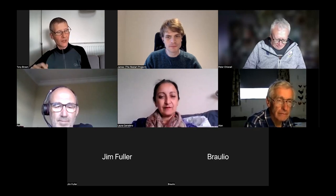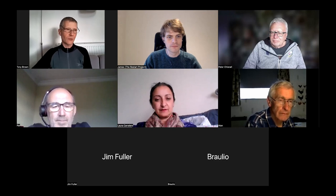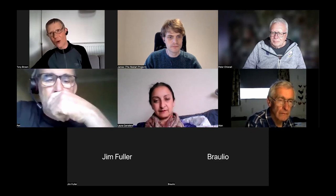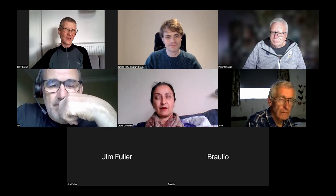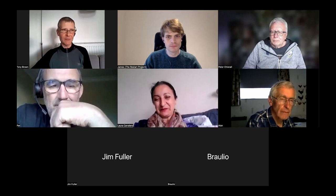Sometimes TVs, I didn't put this on the slides, sometimes they get discarded because of something really very simple. I was embarrassed to have one a little while ago which had a non-responsive control panel, and it turned out the child lock was turned on. It's the kind of thing you can only get at with a remote control, when you get into the menus and play around with it. So that was really embarrassing.